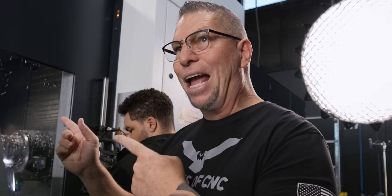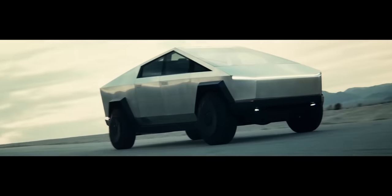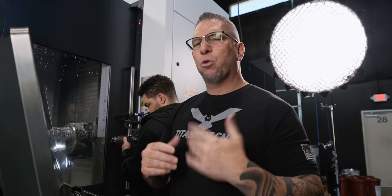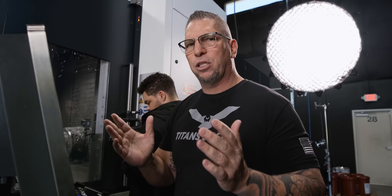Overall, when machining at that speed you're getting the material off in a hurry. And when you have thousands of these gear housings — tens of thousands — like this is an EV gear housing, so electric car builders like Tesla have parts like this that they're going to run tens and tens of thousands of. Being able to run the whole thing at 1,650, even if it slows down, that is productivity. Add the pallets where the machine never stops, all the material stacked up on different tombstones or fixtures — you don't have to babysit the machine, you can literally walk away and it just runs nonstop.